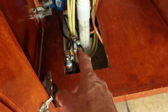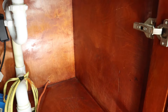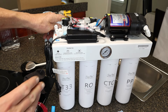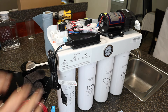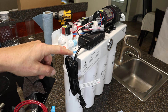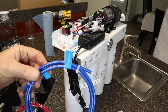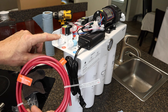I got all the plumbing connections disconnected and the area cleaned out — this is where we're going to mount the reverse osmosis system. Before putting the unit under the sink, connect the rear lines first since you won't be able to reach them once it's installed. There's a blue sticker that says 'outlet water' and a red sticker that says 'wastewater' — blue pipe goes on the outlet, red on the wastewater.